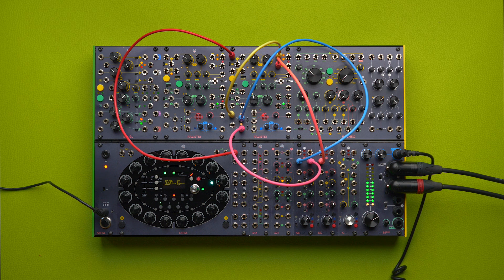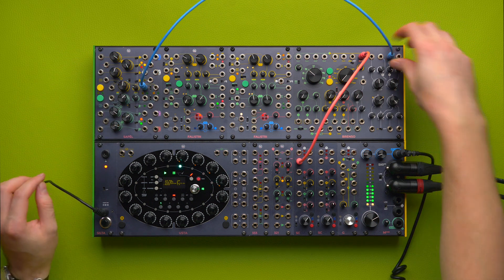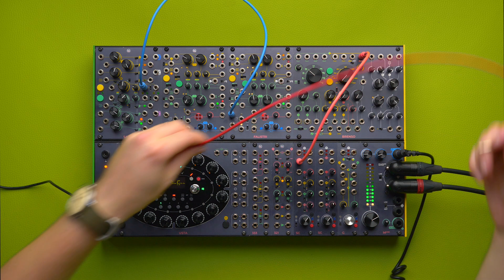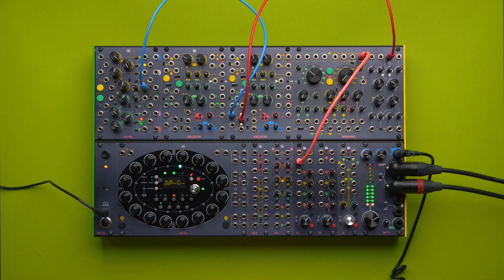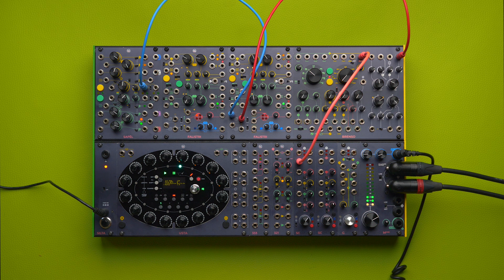We can feed it with many audio signals, but the circuit performs best with pulse waves. We can also feed it with irregular pulses, like Sapel's famous clock output, which we can use to ping the Brainseed — in this case the output will be unpredictable. But as opposed to Sapel's clock output, these will be gates, so we are converting a trigger signal to a gate. I can then patch it to my wave folder CV input.